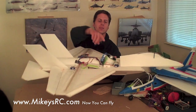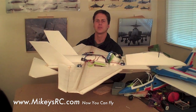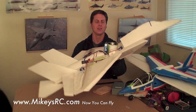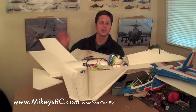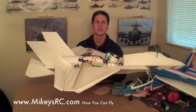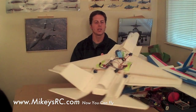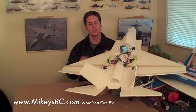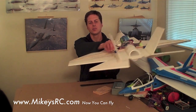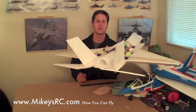I mounted the hover motor in the fuselage, but it's a little too far forward of the center of gravity, so when I kick it down it has a very nose-up tendency — a little more than I'd like. I'm probably going to have to move it back to get it closer to the center of gravity, so it wants to lift more straight up and down. But so far I'm pretty happy with how this jet came out. It was actually pretty simple to build, and right now I'm only using two servos — they control the elevons — and it seems to fly just fine.